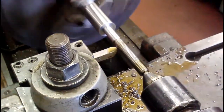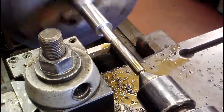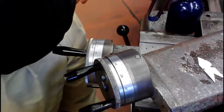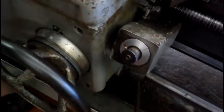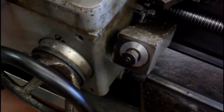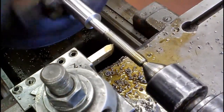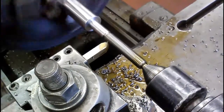Let's try that again — I'm going to disengage it, switch the machine off, back my cross feed out, crank back to the beginning, back to my zero point. Turn the machine on — look, here's where I'm at, six is coming up. I just did a dry run that time just to see if it had any pressure left on the tool. We aren't taking anything — that's it. It does scrape a little bit, which cleans the groove out. Every now and then if you do it that way, disengage it.